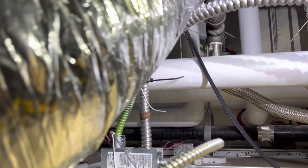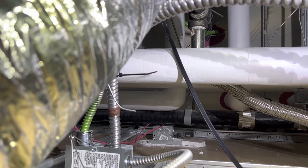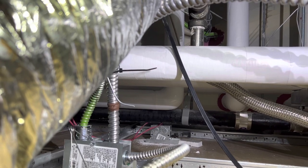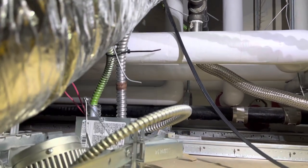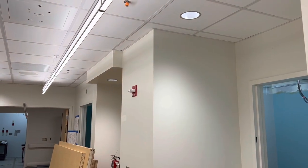Here's my leftover wire. I did a cut-in box — basically I pulled the wire out of the box, pulled the wire out of that box, and did a cut-in box over here. If you've never seen what a cut-in box looks like before with the brackets behind the wall, that's what it looks like — pretty sweet. I cut in this box over here because it was too close to the air duct, which has to be like three feet away. It was basically right next to it, so I had to move it. I put the wire over here and got everything strapped up.